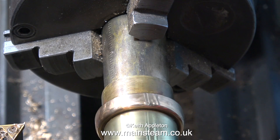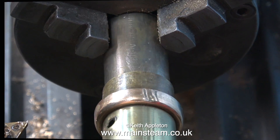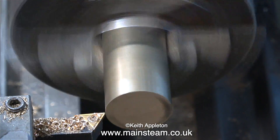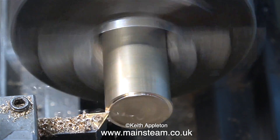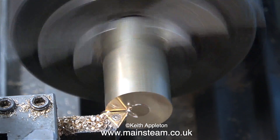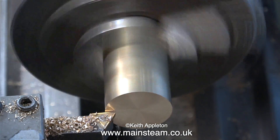I'm making a plug for the base of the chimney. The chimney is not a tight fit on this piece of metal, and I don't want it to be — I'm going to use a couple of O-rings to locate it. Originally the ring around the chimney was riveted to the tube and therefore it wouldn't fit on the piece of metal, but in the last clip once I ground off the rivets on the inside of the tube it fitted perfectly.